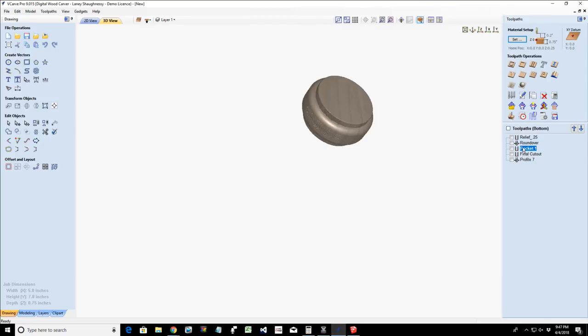My pocket cut rather than an inside profile cut, I could do an inside pocket cut so that little piece isn't moving around or dangling, because I'm not going to be sanding tabs on the inside of that ring, absolutely not. You can do a pocket cut instead of a profile cut for the inside cut. All kinds of different things that you can do. And that's it. So let's see here.